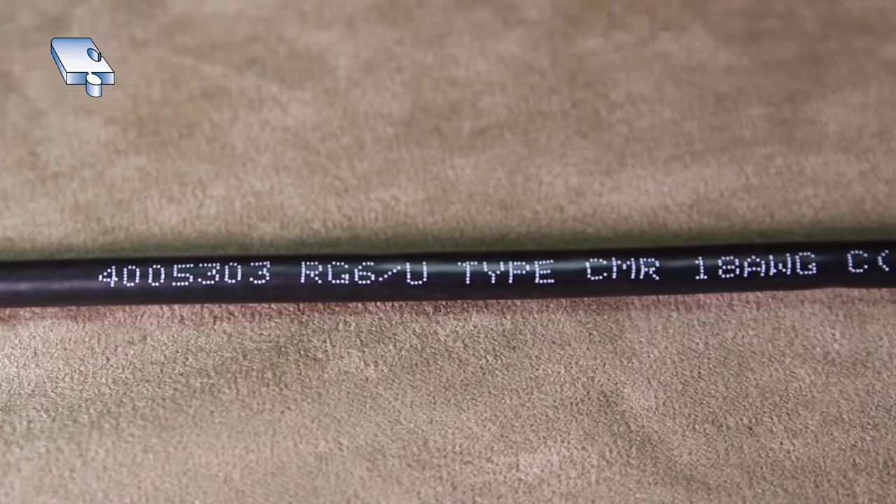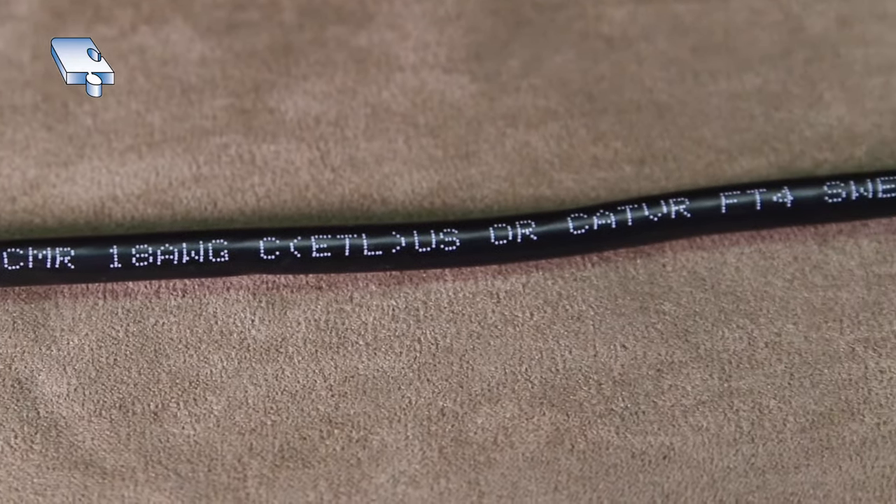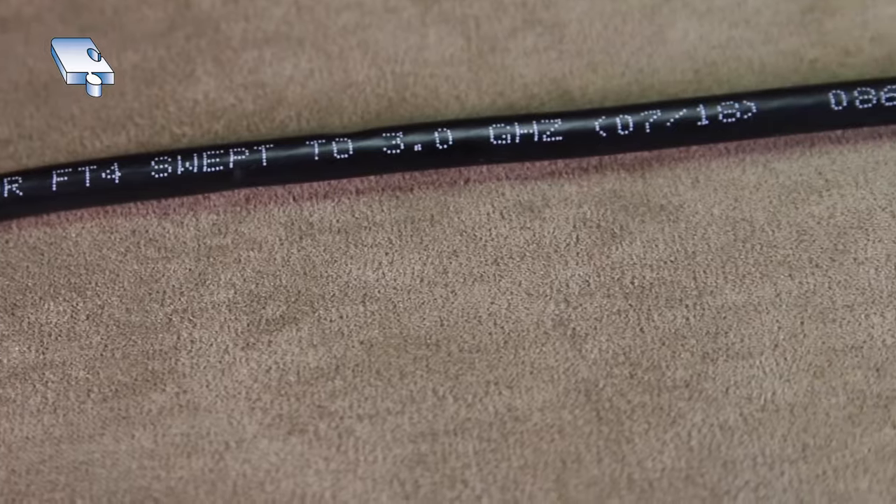To start off we need to get a piece of cable. I've pulled this off a box and when you look at it there's writing on the cable showing things like how much cable is left in the box, fire ratings, and the gauge and style. When you're grabbing a cable and don't know what it is, the first thing you should do is read the cable to make sure it's the right one for your application. Verify before you terminate and put it in place.